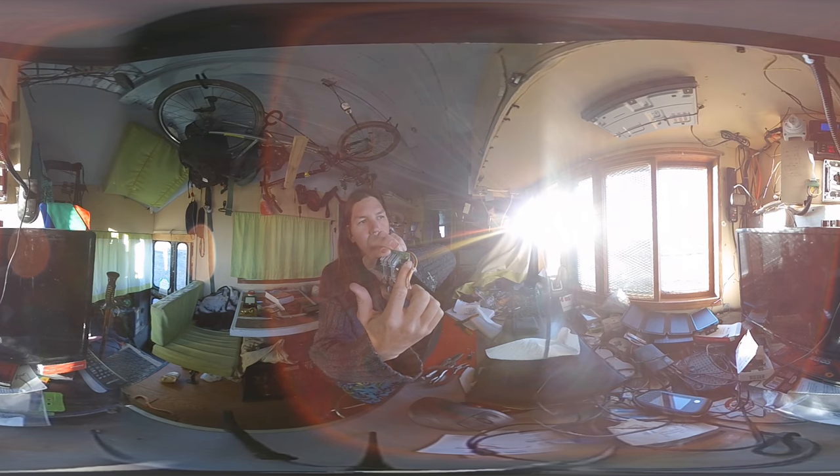The sun's behind me so let me move this where you can see it — the fuse is still good. What I'm looking for on the board is any burnt components. If there's a burnt or slightly hot component you'll see a little blueing around the component leads. If the resistor is a little blue at either end or dark, usually these things will tell you. The LED was slightly lit, which told me this wasn't getting a good connection. I resoldered this a while back and it's not loose — it's not moving at all.